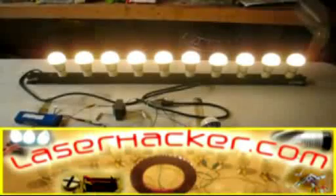We can now use a ferrite core and don't have to use the met glass core. That's really good news because we can get these ferrites for a couple of dollars — I'll give a source on laserhacker.com. The other good news: I've gone to using doorbell wire, so that's a whole lot cheaper, a roll for four dollars. You can make one of these with a roll of this.